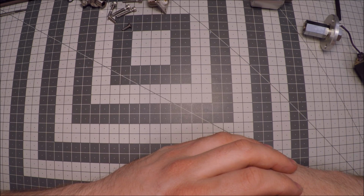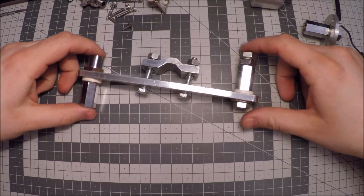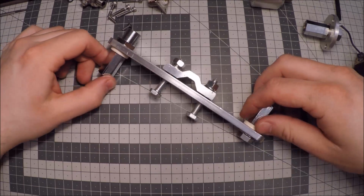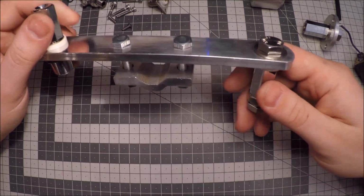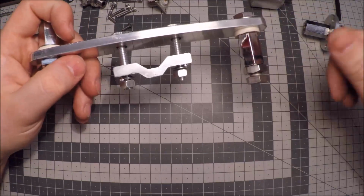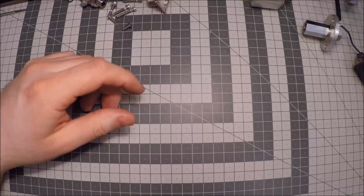Yeah, what more? In this kit from Chameleon, you also get this bar, which has a connector over here, so you connect your coax, and you could make a dipole out of this if you have two whips, or you can use it with just one whip and put on a counterpoise. This is a really nice option that you get, and you don't get that with Alpha Antenna.